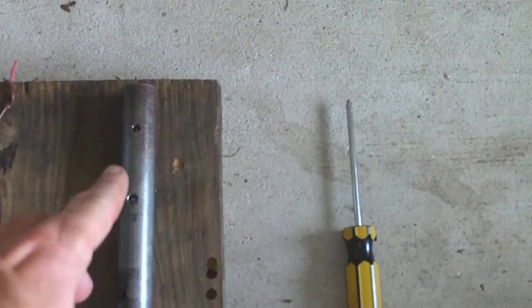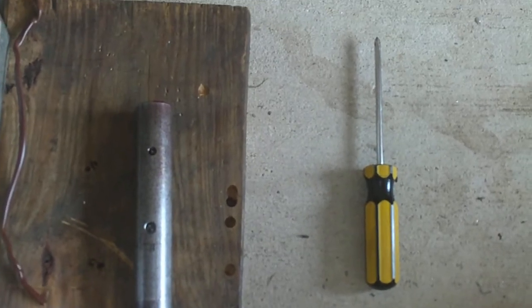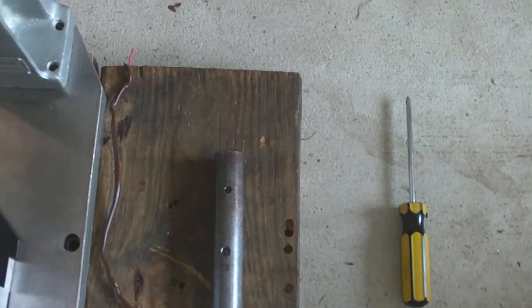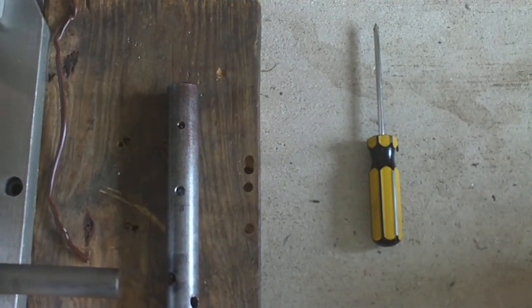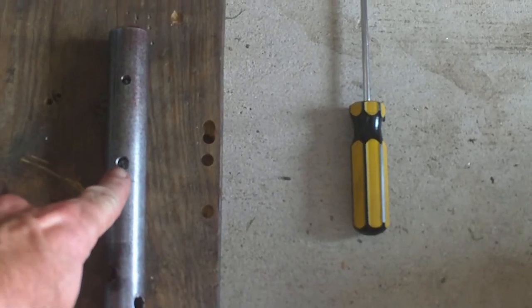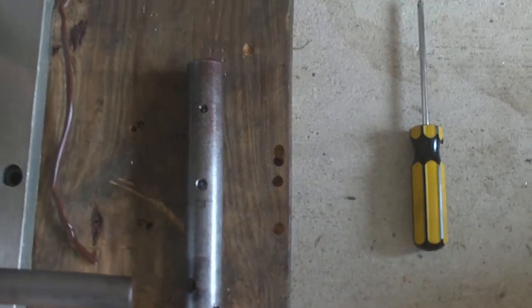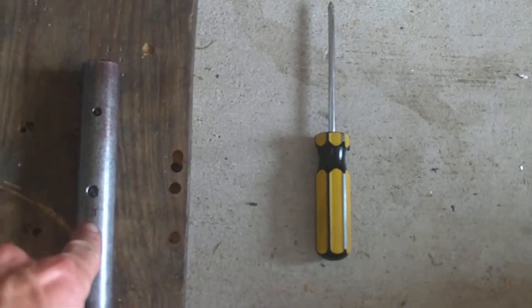What we're looking at here is the one-inch jack shaft. That last hole over here, which is kind of hard to see — that little one on the end is a quarter by 28 tap. There's another hole right here that I've already drilled earlier with the 17/64 drill bit.